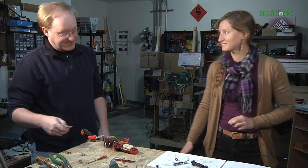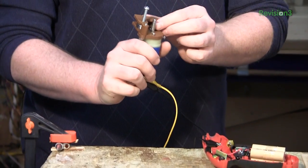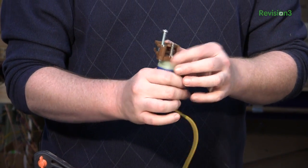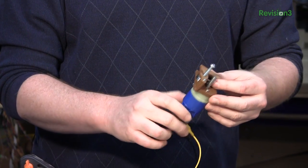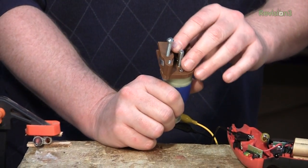We're going to waste so much hot glue building this project! To recap: we tested out a PWM motor drive system that will give us precise control, and we also made an extrusion type that we believe will work. We're going to use this to pinch the glue and keep it tight against the hobbed bolt on the planetary gear system. Now that we know the theory works, in the next episode we can actually build the glue gun around it to make a real-looking device. This demonstrates how important it is to test your theories before you get too far — always test things one idea at a time.